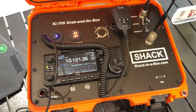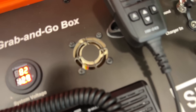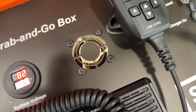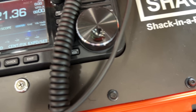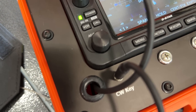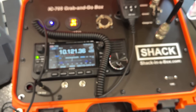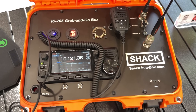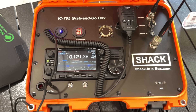They also took care of cooling. There's a fan in there that draws 5.33 cubic feet per minute of air across the radio, with a significant gap left for air intake. It draws air across the heat sink and spits it out with the fan — drawing fresh air in and pushing the hot air out rather than compressing hot air inside.